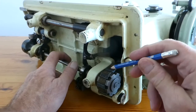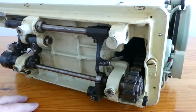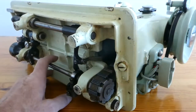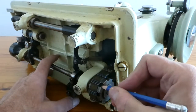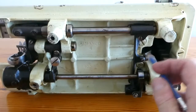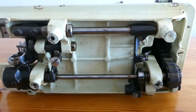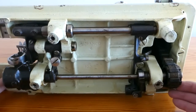This is the metal cloth cleat belt. There's no rubber belt or direct drive motor — this is what drives the machine. The electric motor drives the mechanical motor and the metal cleats go in these grooves here; they are spaced correctly to match. I would oil there, there, there, there — pretty much anywhere you see steel on steel.